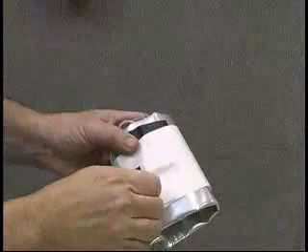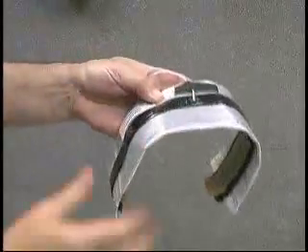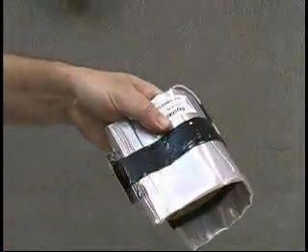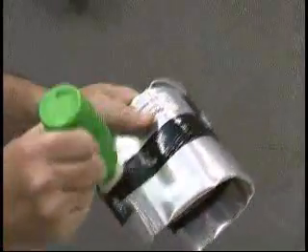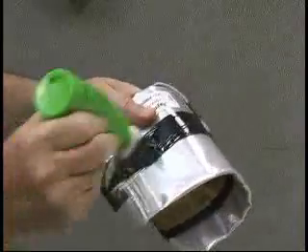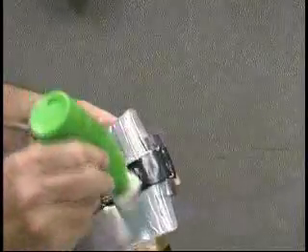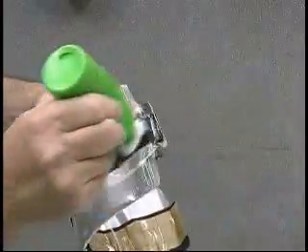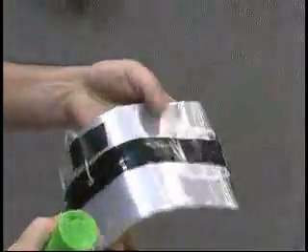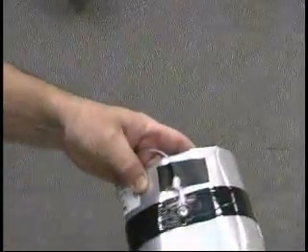Before installing the T-Ducks, remove the protective paper from the outside of the T-Ducks. Thoroughly lubricate the exposed mastic at both ends of the T-Ducks. Lubricate the fill tube area also — this will make removal of the fill tube easier after inflation.